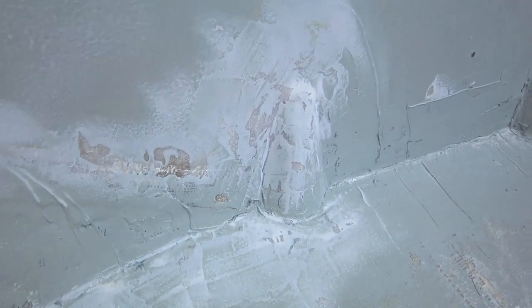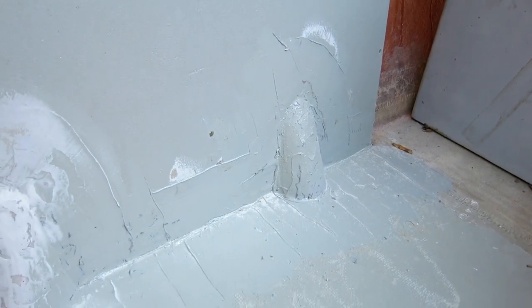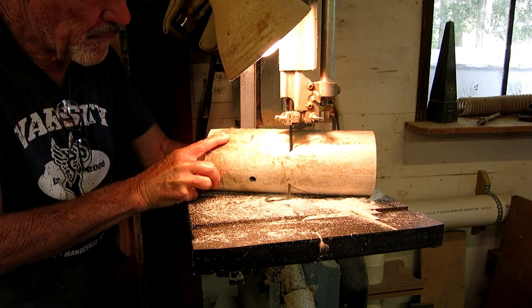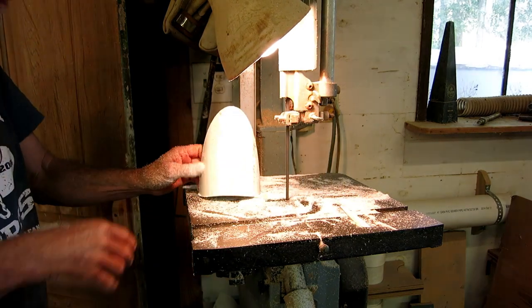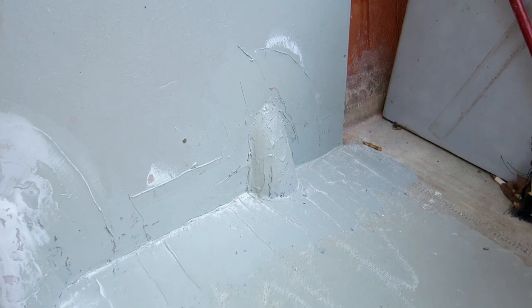And then I had the two little bumps, one electrical conduit there and the fuel fill hose there. And I just took a piece of 4-inch PVC pipe and cut a little sliver out of it and hot glued it on there and glassed over it. And this one we did with a piece of 3-inch pipe. I meant to take a picture of that, but I didn't. But there's nothing to it. It's just slapped up against there and it's got a bunch of layers of glass over it.